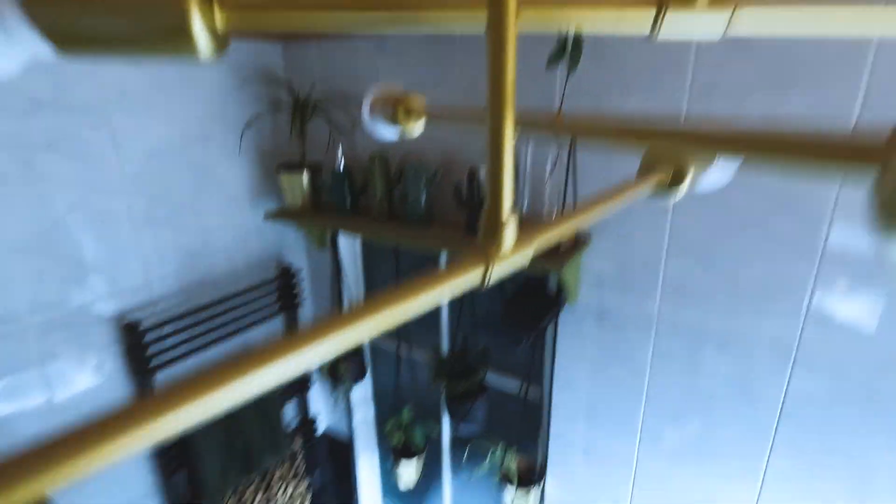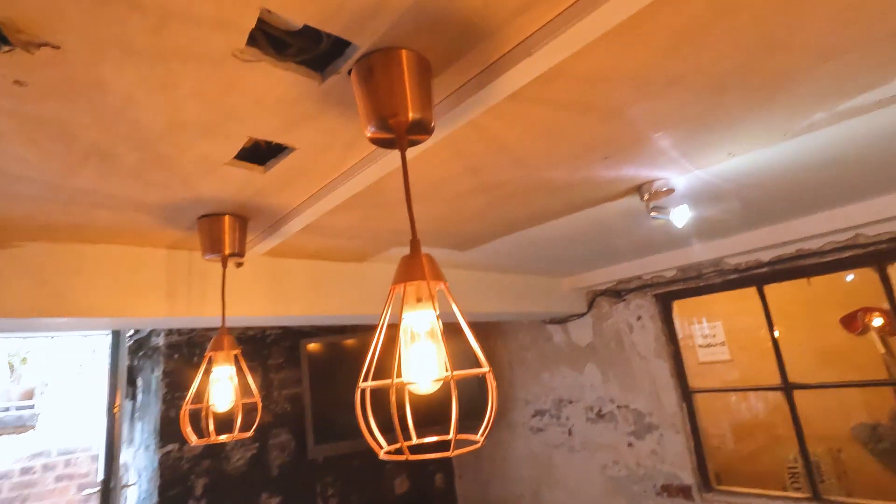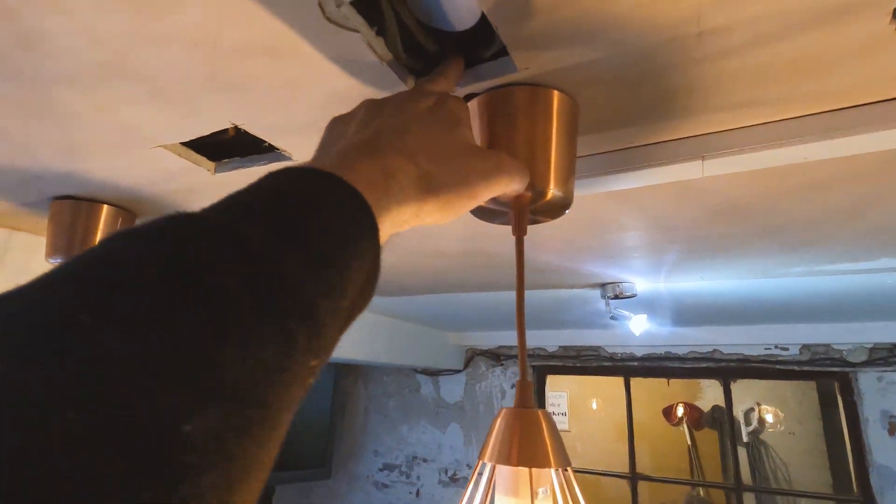Making sure the lights are earthed. The light in the end room wasn't even earthed so we've earthed that. This one here - there's no Earth, just live and neutral. We'd have to drill through a pillar to earth it, or they'll have to go for a plastic fitting or Class 2 fitting. If you touch that and there's a fault, you'd die - it'd be like a human fly zapper. Also got a non-IP rated fitting in the bathroom - that'll go down as an observation needing IP rating. Another light not re-earthed, some junction boxing has probably come off and they aren't taking the Earth.